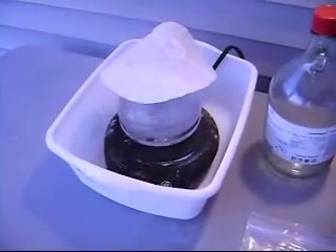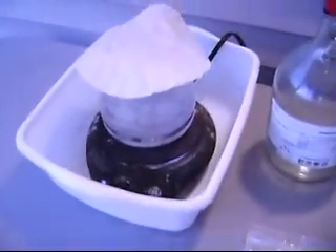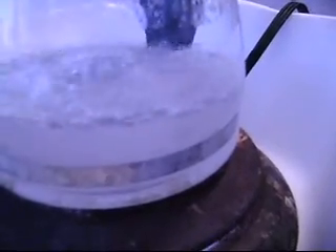Okay, it's been about 15 minutes. I have the 700 grams of sodium nitrate fully dissolved in the solution. As you can see, it's at a nice boil and there is absolutely no sodium nitrate still in pellet form. The key to this process is a good boil — as long as you can get a good boil, you'll get all the sodium nitrate dissolved. I've even done this with 850 grams of sodium nitrate and it worked out just fine.